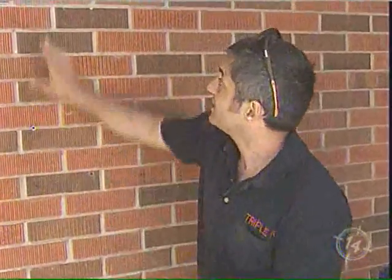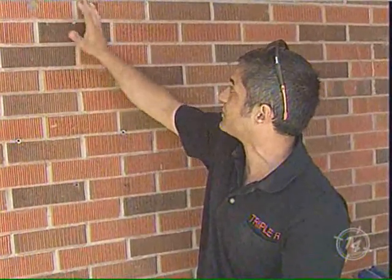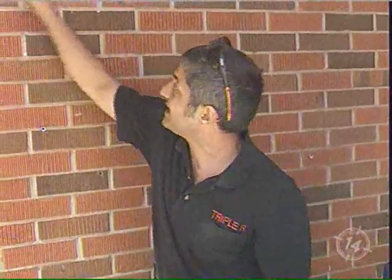When I see the homeowners on Monday, they're going to say, 'Bob, we prefer the gray.' In that case, I pull off the red and fill it with gray — or vice versa. You're not going to get a perfect match. The reason is, you cannot leave these holes here. The water gets in, freezes in the winter, expands, spalls, and pops the brick off. Not good at all.